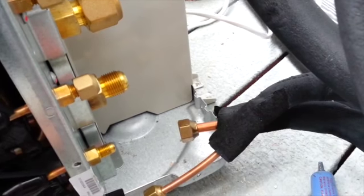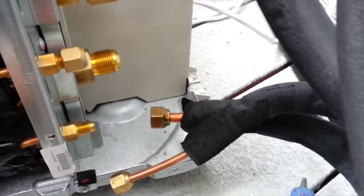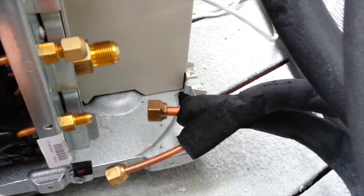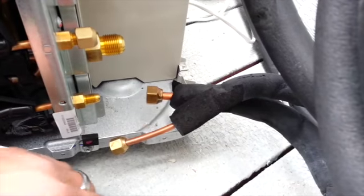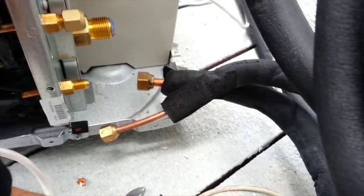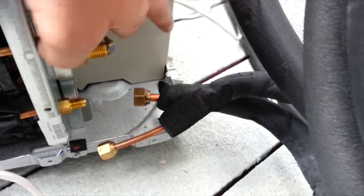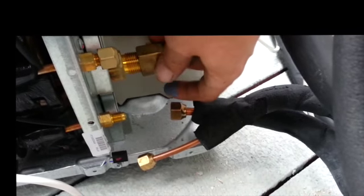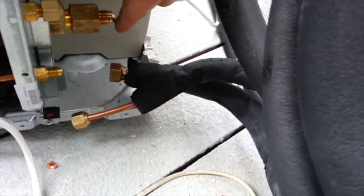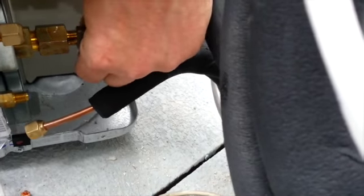Now we get to the point where we are hooking up our refrigerant lines. We have a 3/8" refrigerant line that's going to a 5/8" fitting, so we're actually not able to make that connection without a reducer piece. Along with that reducer piece, we also have to have this little bushing. I want to use some of this leak lock — it just kind of helps so it doesn't leak. We've got it all the way around, stick this fitting on here, dab some on this as well, and now all we have to do is screw this reducer on. We'll also need some leak lock on this little quarter-inch fitting.